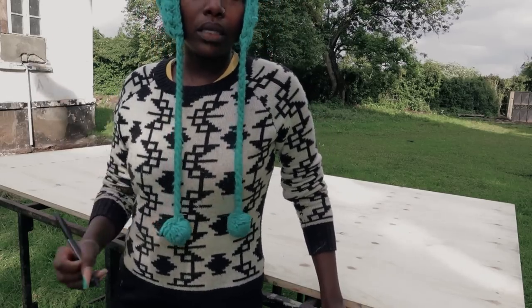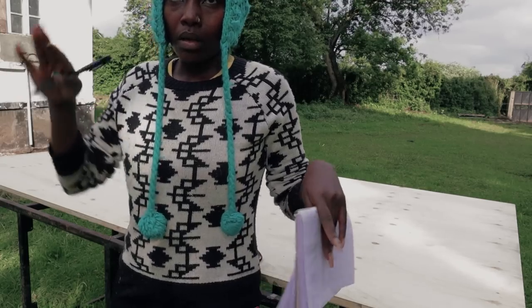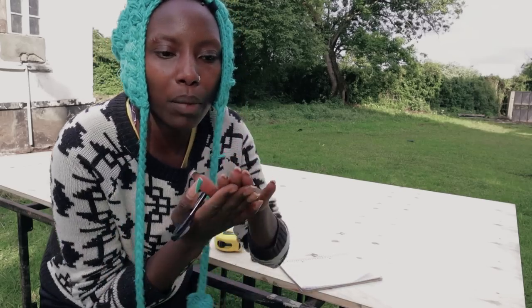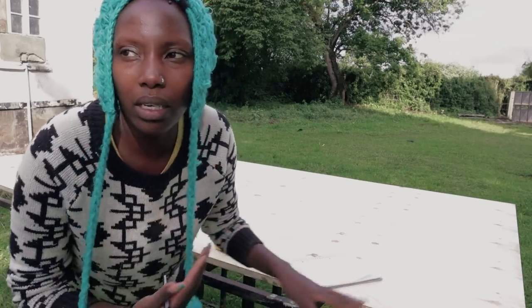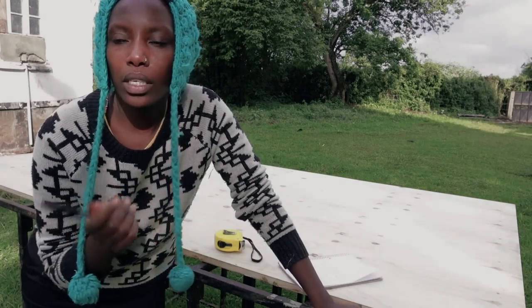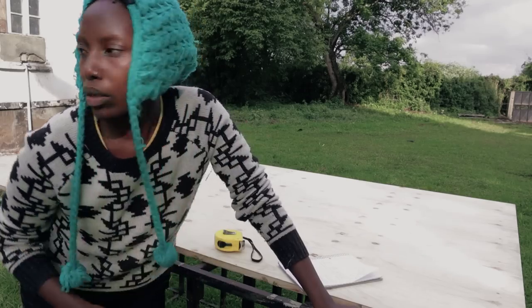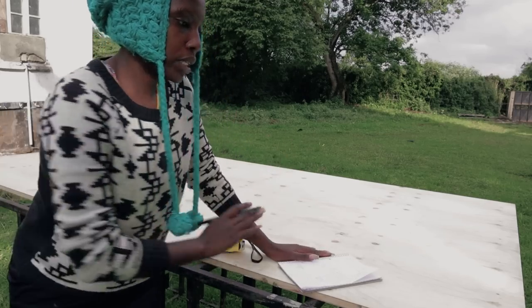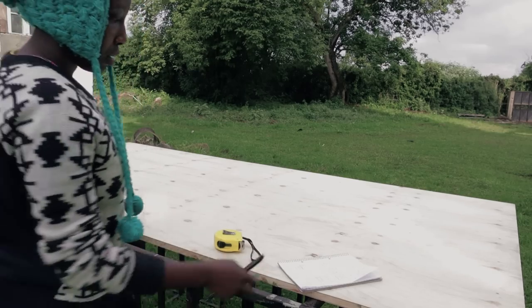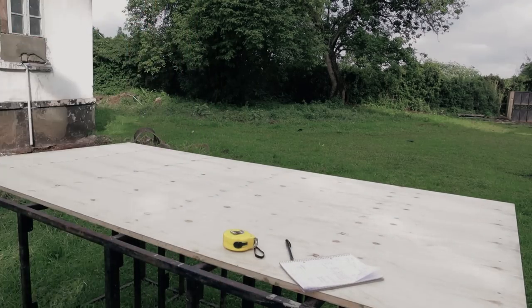81 inches. But because the door will be hanging over the wall, my measurements have to work with a bit of overlap on top. It has to be slightly lifted at the base, because if it's all the way on the ground, it will just end up getting stuck on the floor, which is what we don't want. It also needs a bit of overlap on the sides of the wall, so it's not just the hole that's covered, but slightly over the wall as well. So I need to cut my first pieces for the first frame, and then decide after that, do I want to cut from that side or this side? Let me figure that out right now.